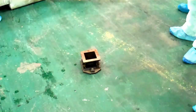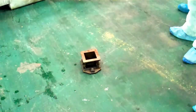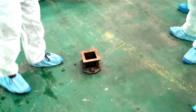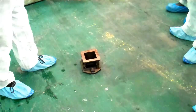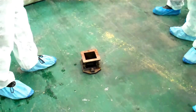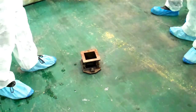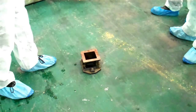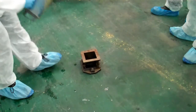What we do is get a sample of our concrete and fill this mould in 50mm layers. So we'll half fill it, then tamp it, then put the rest in and tamp it. If you're doing 150mm cubes, again fill it in 50mm layers, so you have 3 layers rather than 2 layers because it's a bigger cube.